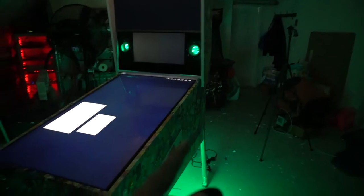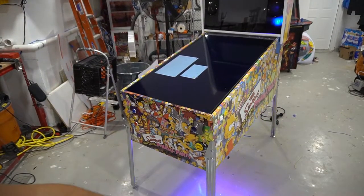The last three channels are for underglow. RGB is a channel and it also links to my speakers. There is a terminal block for LED underglow red — it goes out to the LED strip and also up to the brick which splits out to the speakers. There is a reason for all this wiring. Next is just a G channel, and the last one is the B channel. If you do green and blue together it makes aqua, and if you do RGB together the software gives you white — that's what the LED whiz tester looks like.